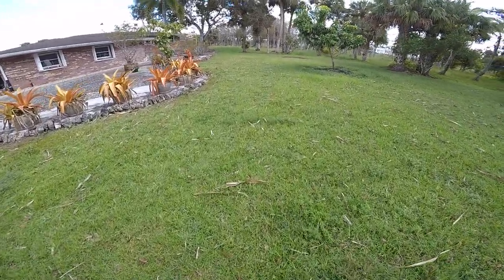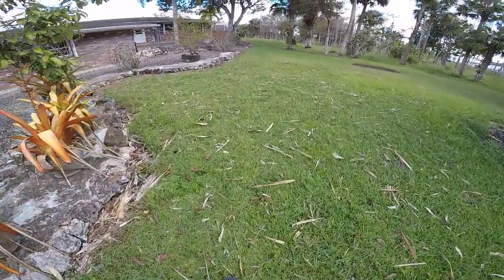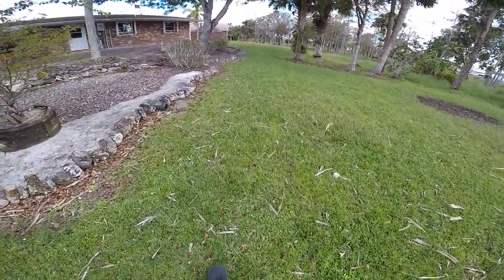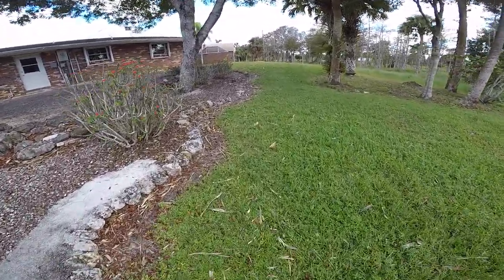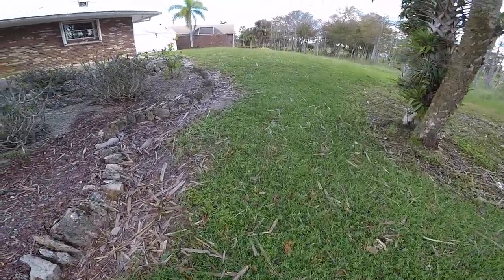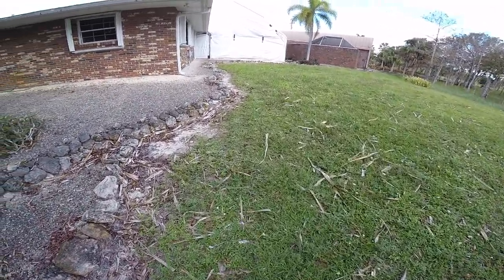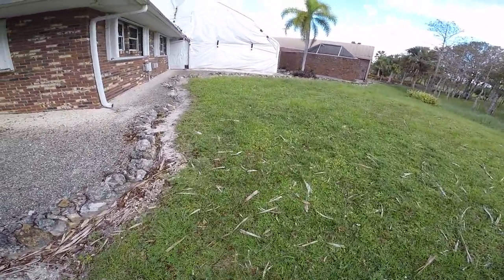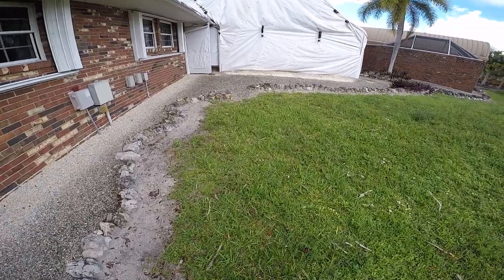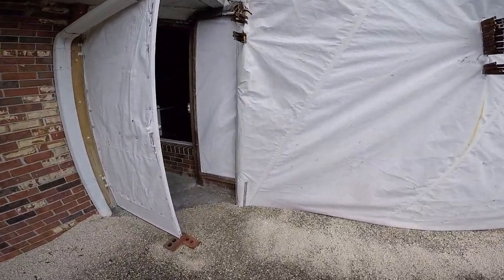Using garden hose isn't the right way to do it — you want hard-wall PVC — but the pressure isn't too high and I was in a hurry and strapped for money, so I used hundred-foot coils of garden hose joined together. After a few years, the brass ends started rotting and leaking, so I had to dig out the connections and replace them with PVC barbed couplers.